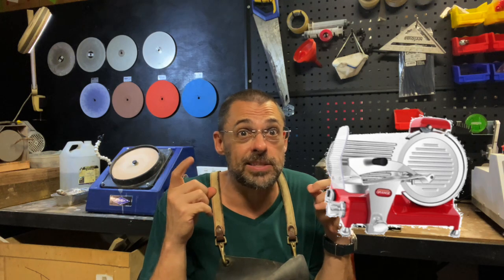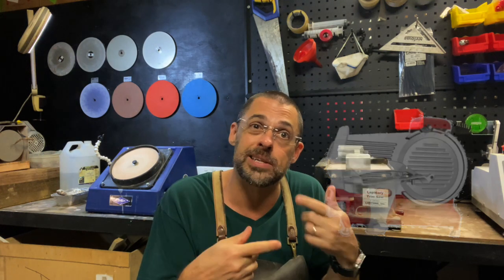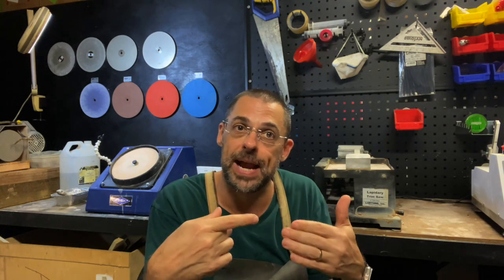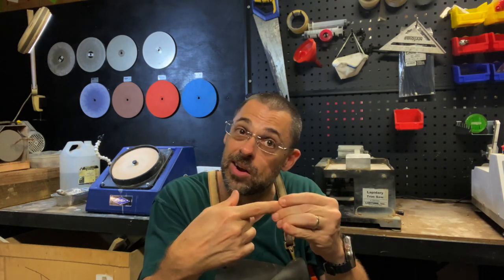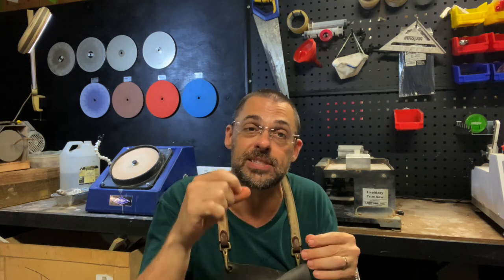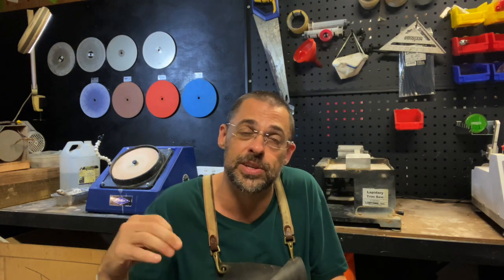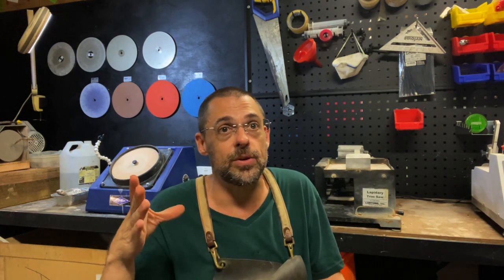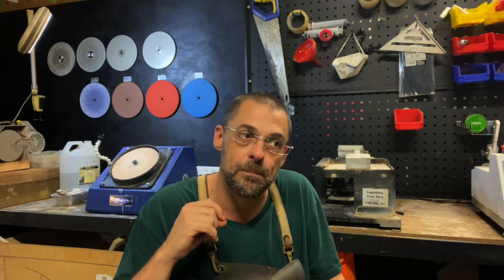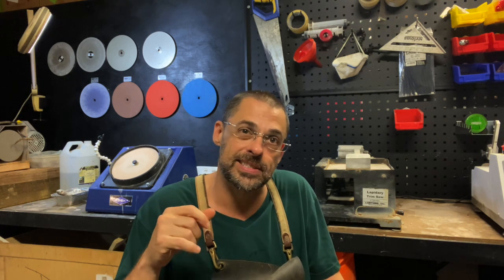And these are the meat sticks, and I wasn't paying attention. I started my saw up and I was making a cut, and my finger went past that sintered bit and got caught in the hole between the sintered bit and the steel, and then I lost the tip of my finger. Luckily, it was just the very tip and it grew back. The lesson here is not to be complacent when it comes to these machines, and to respect them, and if your blade starts to rust out, that's the time to get a new blade.